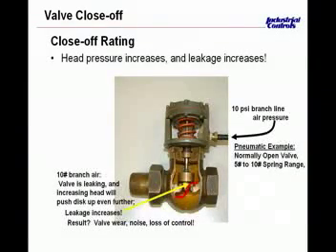The water or steam coming across this plug has such a small area to pass through as it leaks that it actually starts to cut into the valve seat and into the plug assembly, eroding away a section of the metal. Over a long period of time, you'll get a valve that continues to leak and will not be able to control the system. When troubleshooting this, it's helpful to remove the bonnet, inspect the plug and seat, and use that as evidence to select a different valve and actuator combination when replacing it.